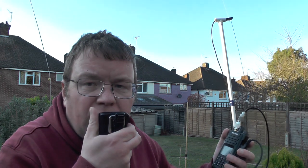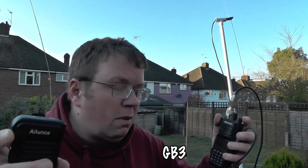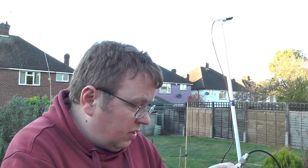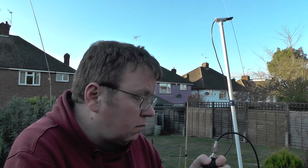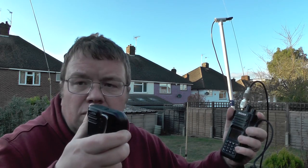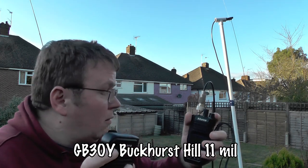We're trying to access a few repeaters. I've filmed this on a Sunday evening, so you may not get a contact back, but as long as we can get into repeaters we should be okay. We'll try GB3VH at Welwyn Garden City, which is around 8 miles away. 2E0 IQJ checking access for GB3VH — a lovely strong signal coming back. Let's try GB3OY, around 11 miles away. 2E0 IQJ checking access for GB3OY — GB3OY has come back to us, so we're getting about 11 miles so far with this home-built no-solder dipole.